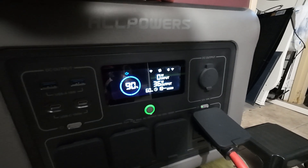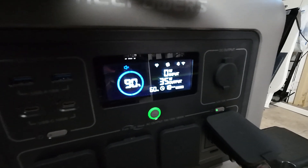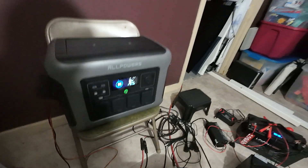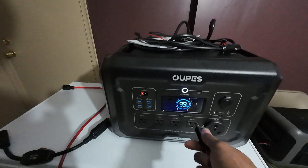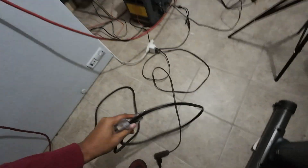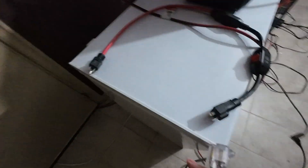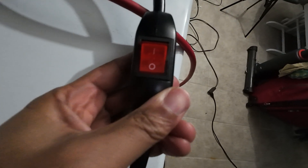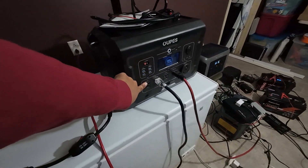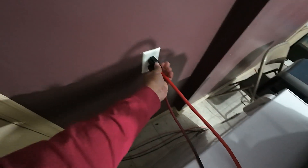It's a little dark down here because I just cut power to half my house, which is why I brought down this lamp. This side of the panel only uses about 40 watts if the heat is not on. It mainly controls the top half of my house — my kids' room, the back room, upstairs, and one outlet in my kitchen. I'm going to unplug this, pull a little extra wire out, and plug it in. This is a 10-gauge, 10-foot cable. Both cables are now plugged in, with the switch in the off position as redundancy — so the live end is not exposed.